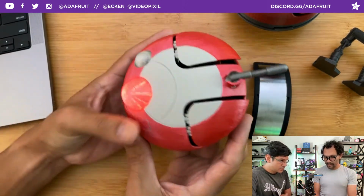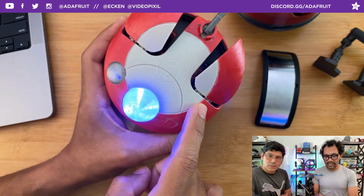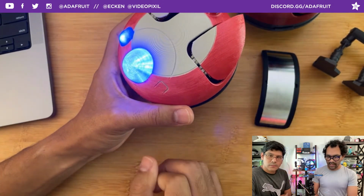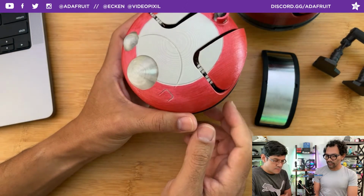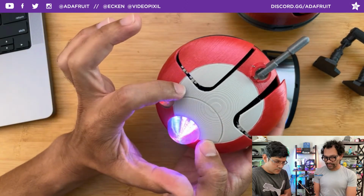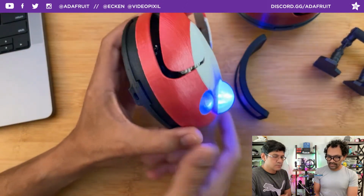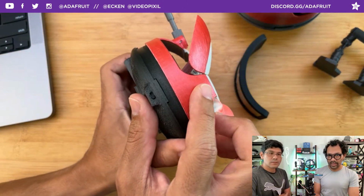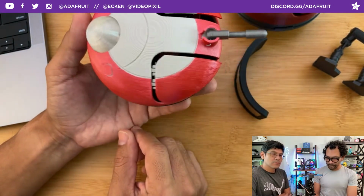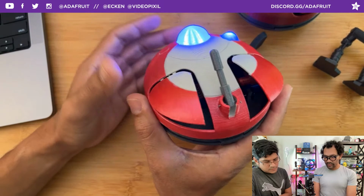So it looks good. Yeah, so this is the smallest that we've been able to get our hinges for the wings. Before, we used an M2 screw, and it still ends up being a pretty wide knuckle for the hinges when we model that. So we're using a paper clip to hold everything together, which is about 0.8 millimeters thick, and that allows us to make the hinges way smaller and hide them into the underside of the whole droid. Cool. Would you say the most challenging thing about this was the wings? Yeah, getting the wings to flap up and down.